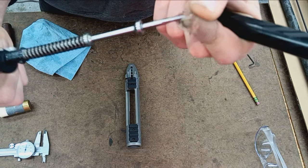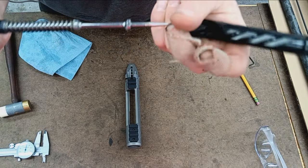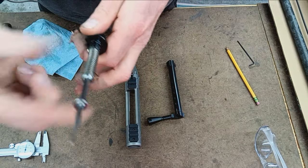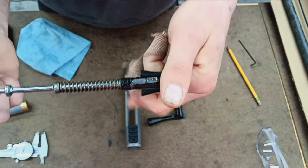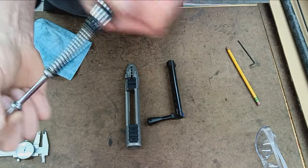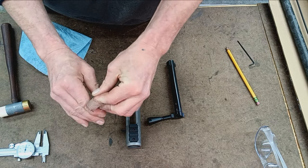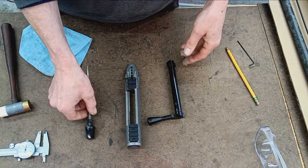Pretty impressive looking firing pin. There's a nice layer of grease on everything. The spring is not snaking around the pin, so that doesn't interfere with the forward travel of everything. Keeps ignition and the entire system a lot more consistent, shot to shot. So that's nice to see. It's a fairly powerful spring, probably 26-ish pounds, something like that, which is pretty typical.